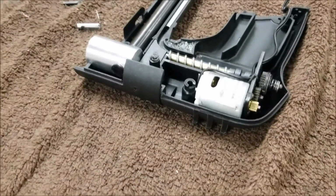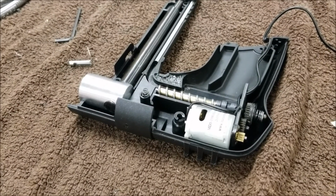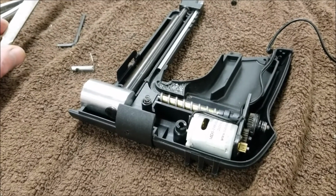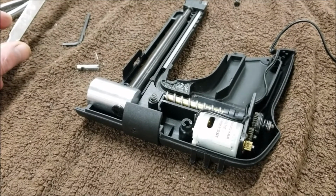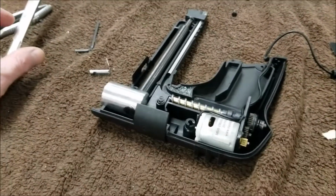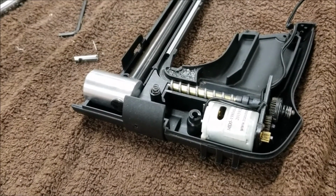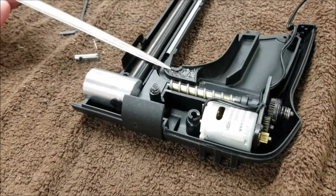And this little part right in here has been the bane of my existence. That's not to say that it can't be overcome with modifications, but again, this was never designed to shoot anything more than a 6 round burst at 600 rounds a minute, which it does absolutely fine. It works just great up to 1200 rounds a minute, but beyond that, you really got to get in here and start tinkering around with it to get it to work, and adding voltage and all that stuff. Now, in our gun, all this is metal, the way it should be. So, I haven't had any jams in there, and the one that I've been wailing on for a few weeks now.